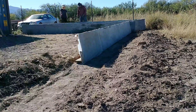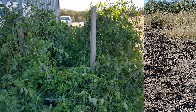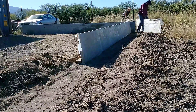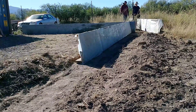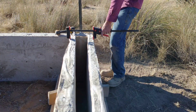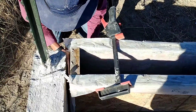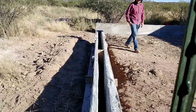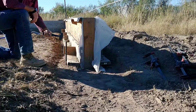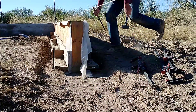Here we are moving the forms over for the final section of the garden wall — the long section that will run the length of the connex, which itself acts as the last wall of the garden. This final wall is about 40 feet long. The forms are 24 feet long, and we decided to keep them all together this time instead of splitting them up — we were able to just manhandle and drag them over, keeping the plastic on. It's a bit heavy but doable, and saved a lot of time. I'm trying to get everything squared up, level, and flat.